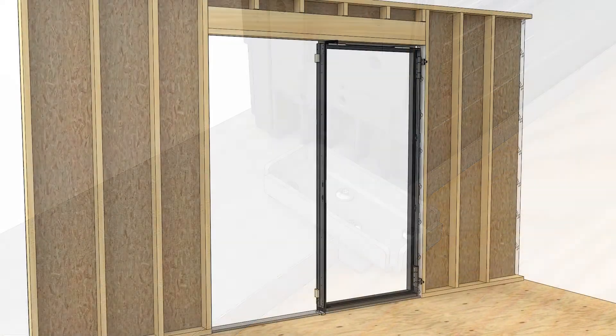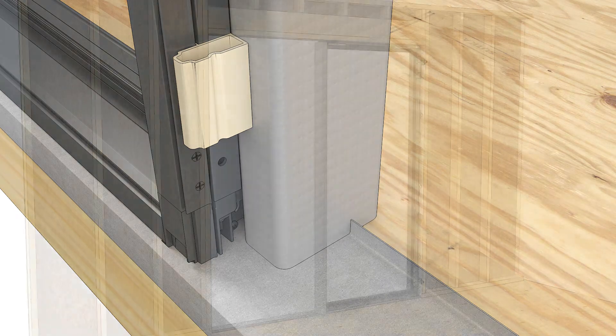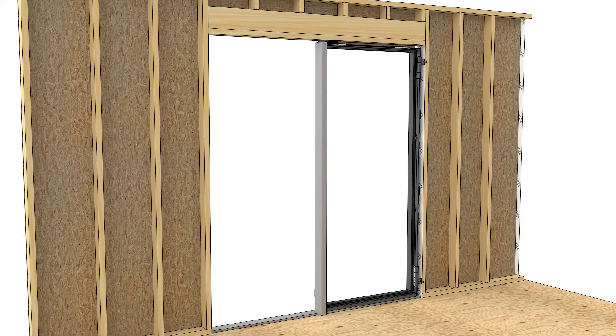Fit the bottom of the tube steel over the flanges on the sill bracket and position the steel tight against the mull filler blocks. Make sure the bracket sits flat on the sill and all mounting surfaces are on the same plane with adequate structural support beneath. Shim if necessary. Clamp the tube steel to the frame.